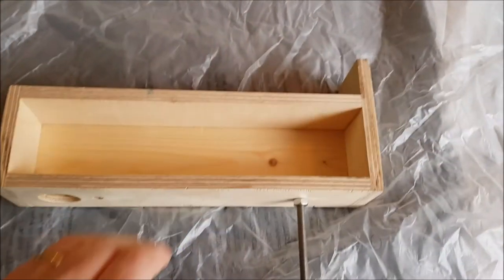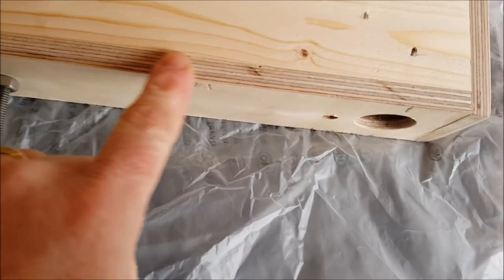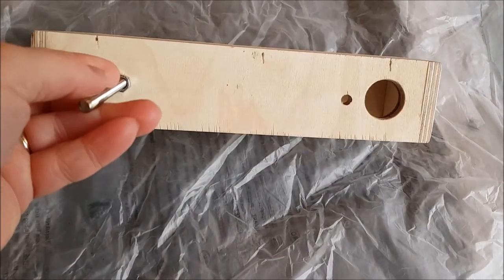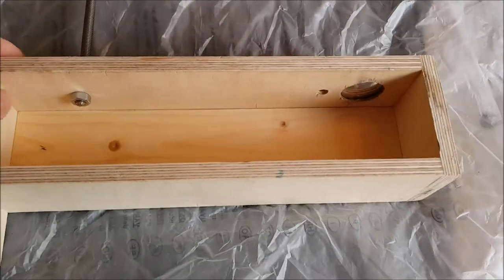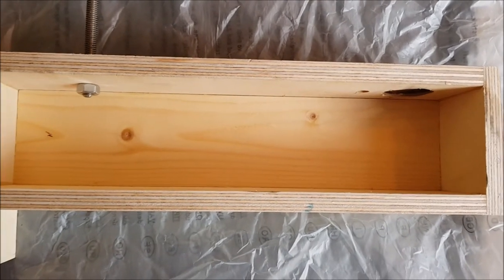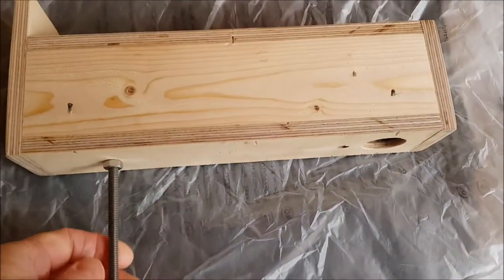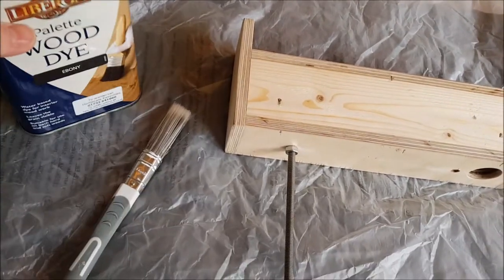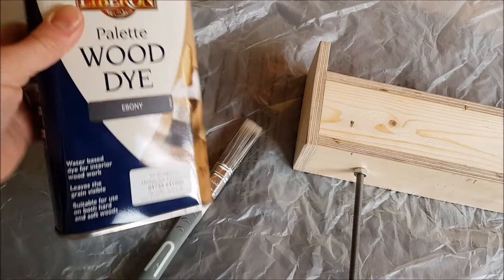Let's go and see if Mike's finished the box. Whilst I was in there flipping the socket over, Mike has built this lovely box — just a couple of bits of nine-millimetre birch ply around the outside and a spare old bit of wall cladding, probably from my office build. So a few scrap bits of timber, some pins, and a bit of glue and we have an extension. We're going to bolt this onto the back of the existing tray to make it a little bit longer. One of the sides has an extra leg on it, so that when the tray is pulled out — remember it sits diagonal across the front — it comes out the same distance as the longer side.